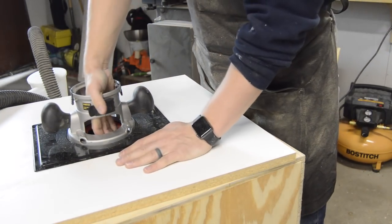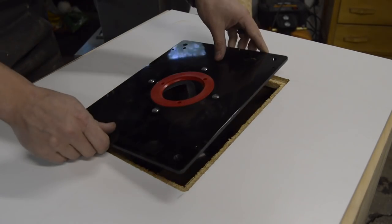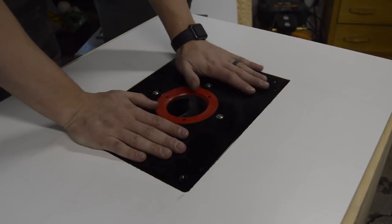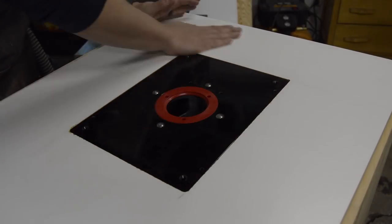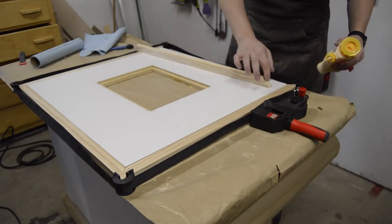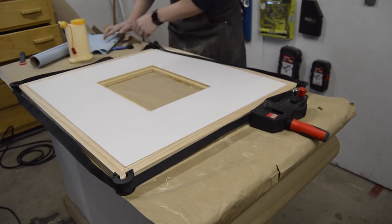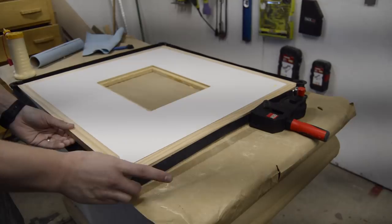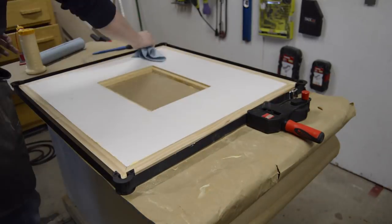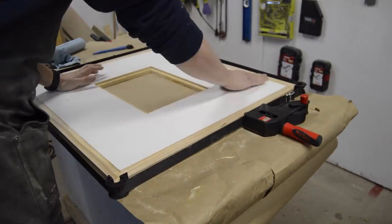I actually used construction adhesive to hold the plate in place. Even though it fits perfectly, when inserting the router into the plate from below, I found that I would periodically push the entire plate out of the recess. Construction adhesive fixed that right up. A perfect fit. To finish the top, I glued the edge banding on. I used a strap clamp to initially hold it in place, and I used a lot of glue where the banding touches the exposed melamine end grain because it soaks up a lot. I also used a few clamps, but it's important not to exert too much pressure on the router plate hole, as the thin lip around the inside is quite weak and can break very easily.